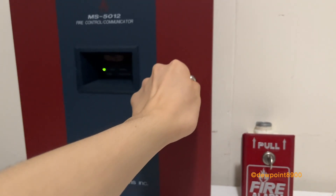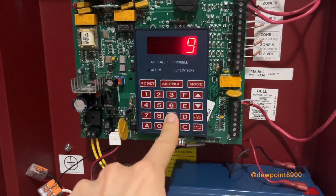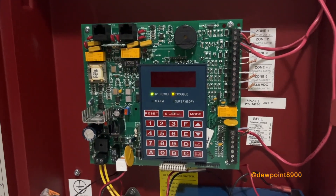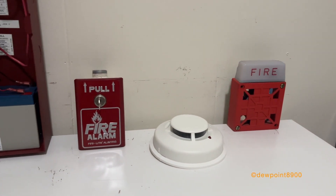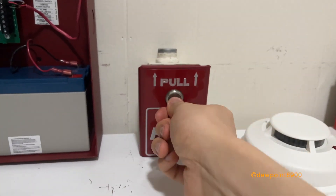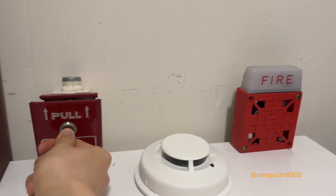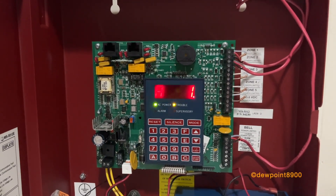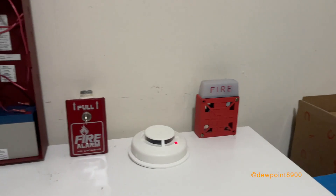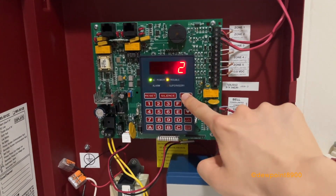Let's start with a quick walk test. To enter certain functions on this panel, you have to enter a code on the keypad — press mode, then enter the code. The codes are the same for all the panels. Now we are in walk test, and the trouble LED indicates. Walk test is just like many FireLite or Notifier panels: when an alarm is tripped, it sounds the signal for four seconds; if tripped again, one second. The keypad keeps track of the last zone alarmed, which in this case was zone one. To exit walk test, you can reset or just go back to normal mode.